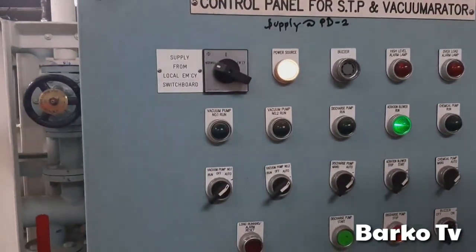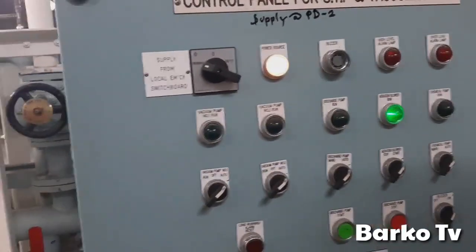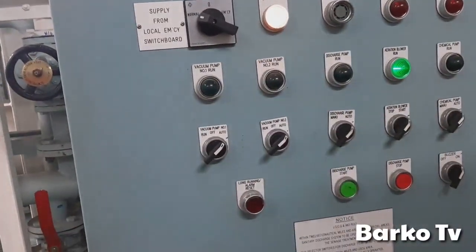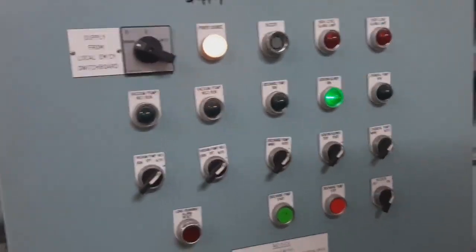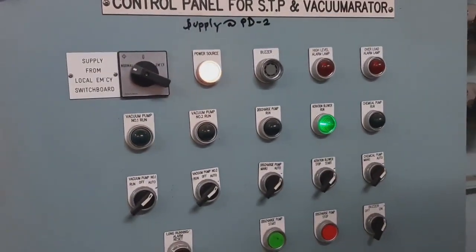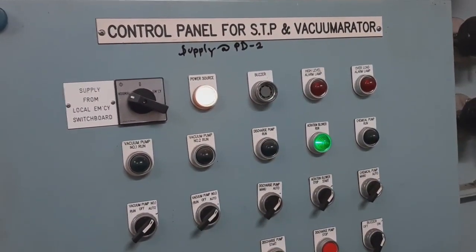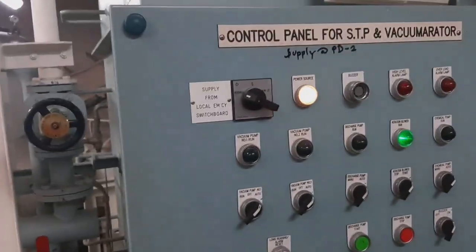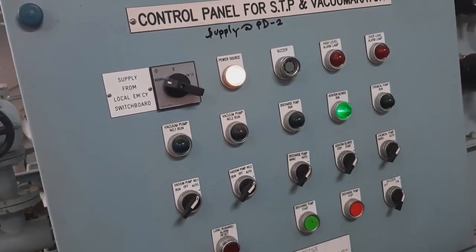You already turned off all breakers there? Yes, they are all off normally. When you need this to run on emergency, then you turn it on. But if we forget to turn off, it's a fail-safe because the power is turned off. Best practice is to turn everything off when you're not going to use it. If they turn it on like that, it's a contactor that is fail-safe. There's a sign on the number two main air compressor — the sign says you need to turn off the main air compressor number two before you use all this. But usually they don't have an interlock, so in case you turn it on with the other one also on, it won't trip it — there's no interlock between them.